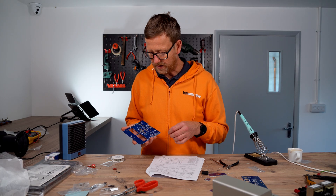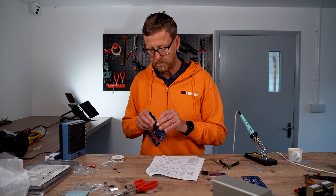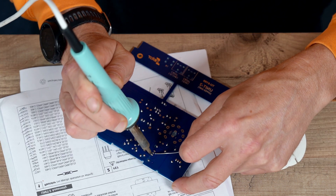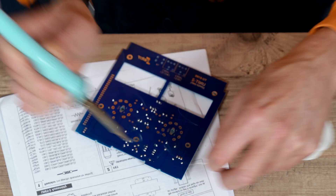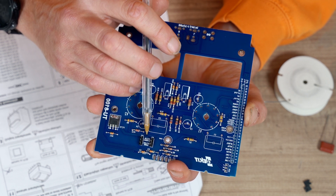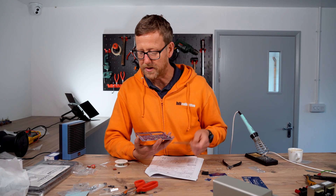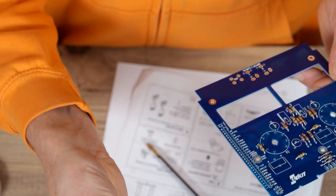So here we've got short posts, so this is for jumpers. If you read the PCB there, it says there are options to use the ECL86 or the PCL86. The ECL86 takes 6.3 volts on the AC heaters, whereas the PCL86 takes 12.6 volts — that's probably why the jumpers are there. We are using the PCL86.